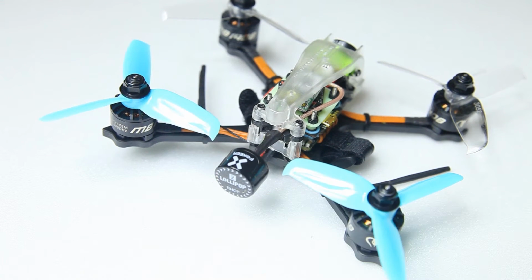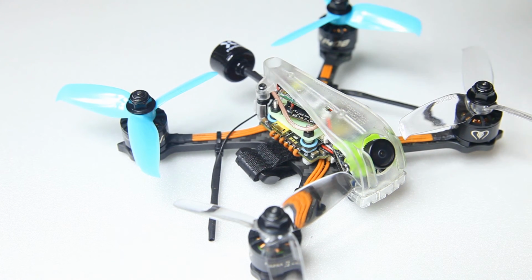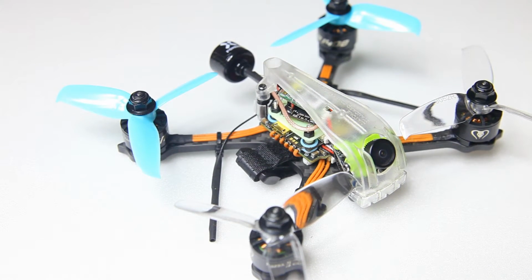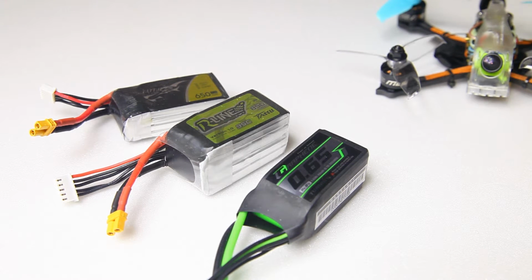I think a circular polarized FPV antenna would be a worthwhile upgrade for Diatone to make on this quadcopter. It simply works out better, and the quadcopter would be a little more expensive, but I'm pretty sure people will want to pay, say, 10 euros more for that quadcopter if it came with this antenna. You'll have more faith in your FPV feed with an antenna like this. Far better than the sleeve dipole antenna. It wasn't horrible, that sleeve dipole antenna, but this is simply quite a lot better.